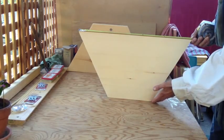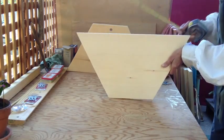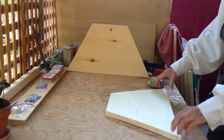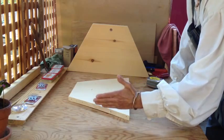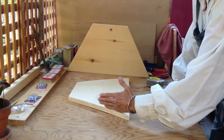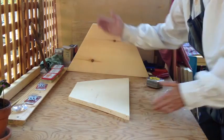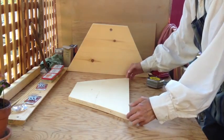When you cut a regular 1 by 12 piece of wood from your local hardware store at 21 inches across, and at an angle of 60 degrees — in other words, on your chop saw, which normally goes 90 degrees, you move the blade to 30 degrees and chop at 30 degrees on each end at 21 inches — this will give you a trapezoid.